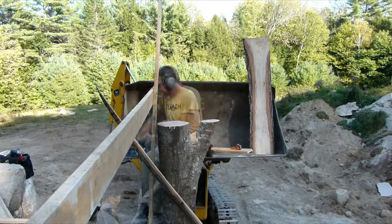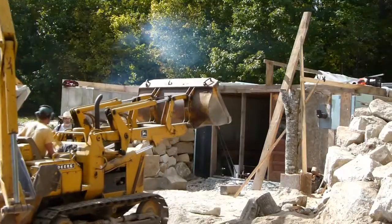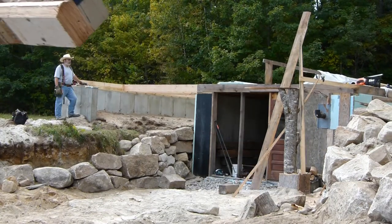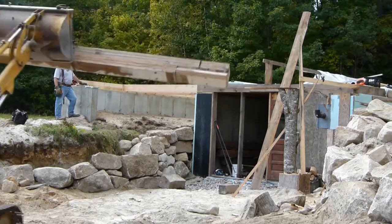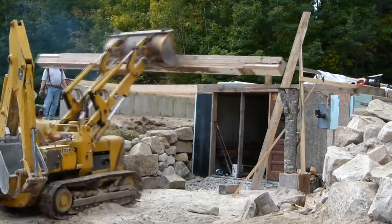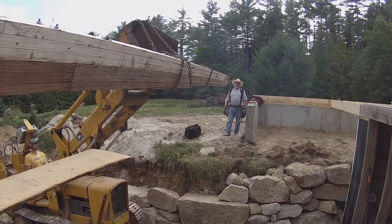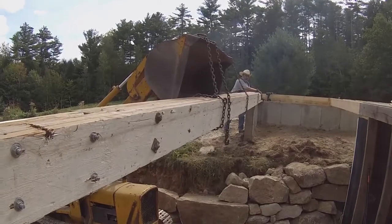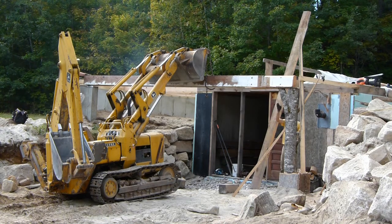So I had to tune up the top a little bit to get ready for placing the big laminated beam, which I was given 3 of these massive lam beams earlier in the year by my neighbor up the road, Ben. He got them from work, couldn't use them, so I laminated 2 of them together and scabbed on a little bit on the end, so I got a 22.5 foot long, 10-inch deep, 11.5-inch wide beam that should hopefully be able to hold up the world, because this is going to have some serious point loading. I've got about 20 12-inch carriage bolts sandwiching it together.